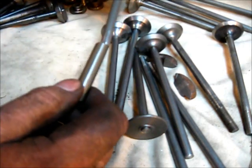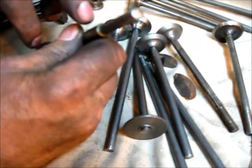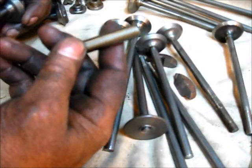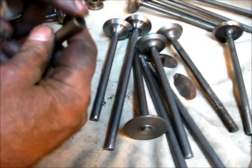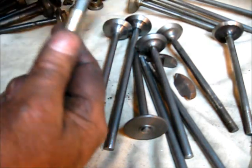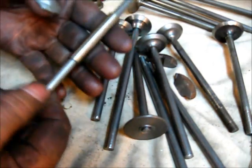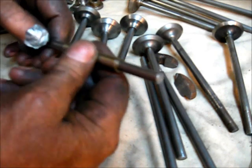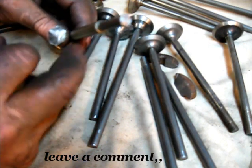The valves we just made — if you put this valve stem in this guide, when you press this into the head it will actually shrink it. I will have to run a reamer through here to restore the size. It's an interference fit — it's supposed to do that. The stem works like that; it's supposed to be a non-interference fit with no friction whatsoever. It's not loose — I really don't know how to describe the fit of that.